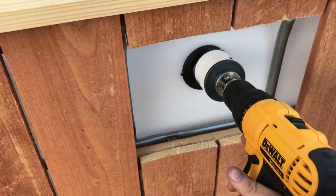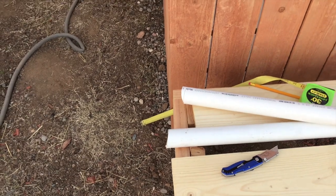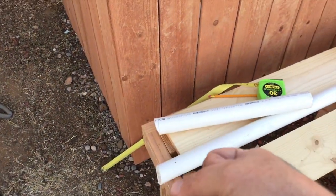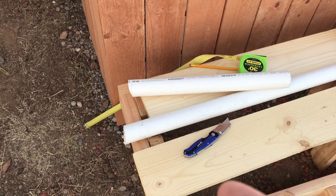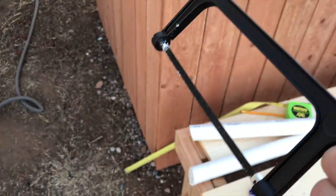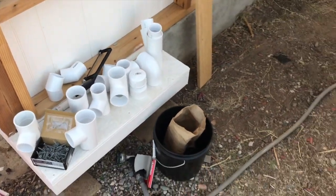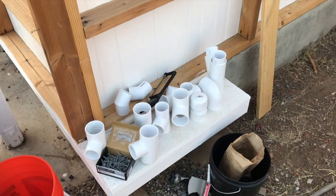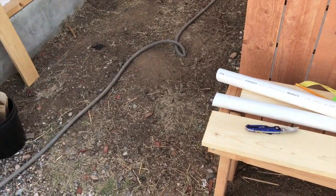A 2.5-inch hole saw for the 1.5-inch uniseal. I started cutting pipe, and I know they have those clampy things with a blade that slices through them. I have one somewhere, but the one I have, an economical one, only goes up to like 1 inch. So I went and bought this stupid mini hacksaw for $3 or $4. I thought, oh, that would save me a lot of money. And the blade's so flimsy, when you're cutting, it starts curving. So screw that. I'm gonna bite the bullet, go in tomorrow and buy a blade thing that'll go up to 2-inch and just use that. It's a lot cleaner and easier to use, quicker. So as long as a 2-inch can still do 1/2-inch width, then it will be economical.